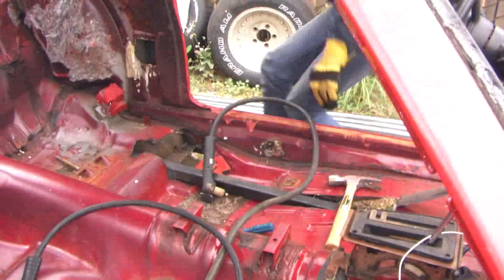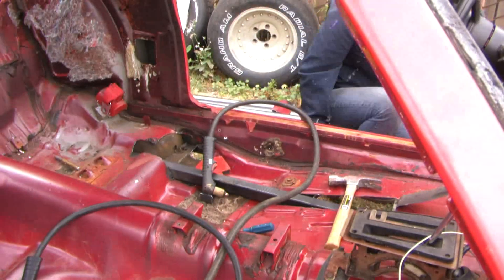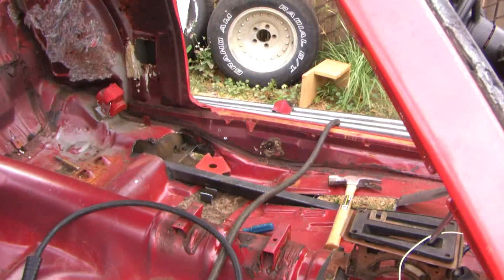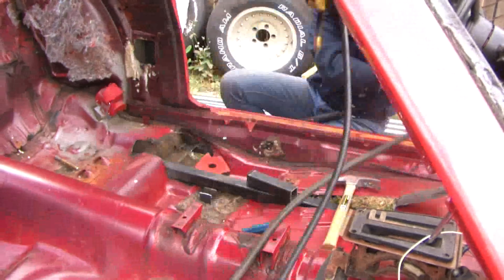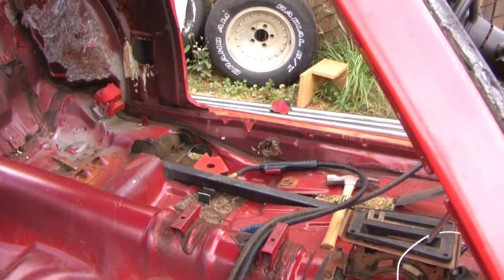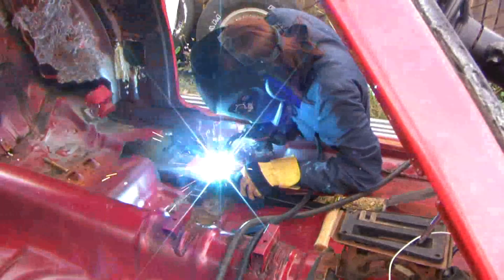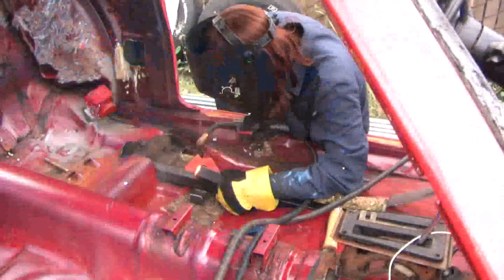Here I'm cutting a piece of square tubing so I can bend a flap over. I can't emphasize how important this is to cap off the end of all pipes. I've seen many race cars that have open pipes, and they get in crashes, and there might be another pipe that is attached to the tube, and it'll rip right out at that point. So close off the ends of all tubes — there I'm sealing the end of the tube so it'll be much stronger.